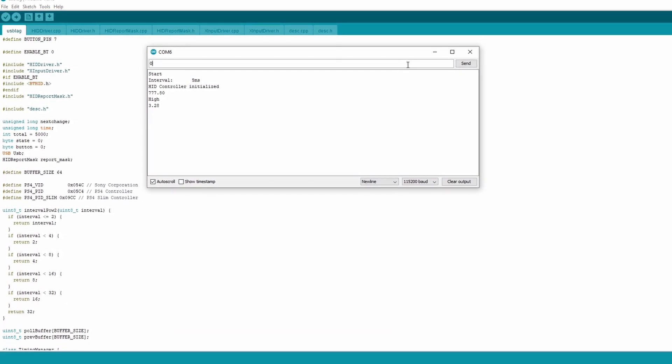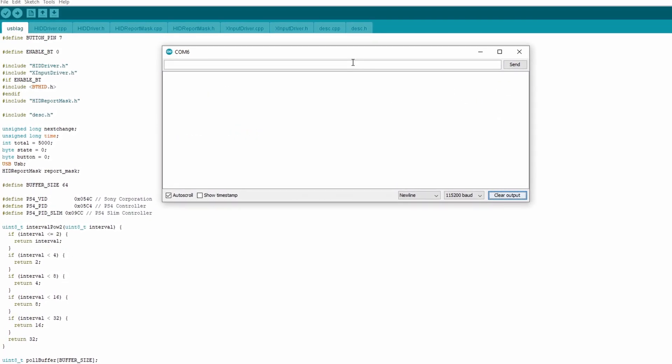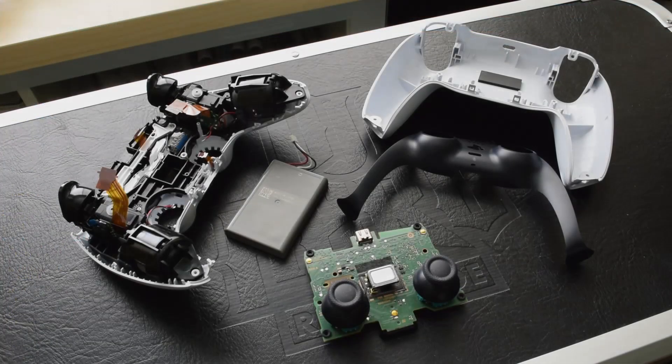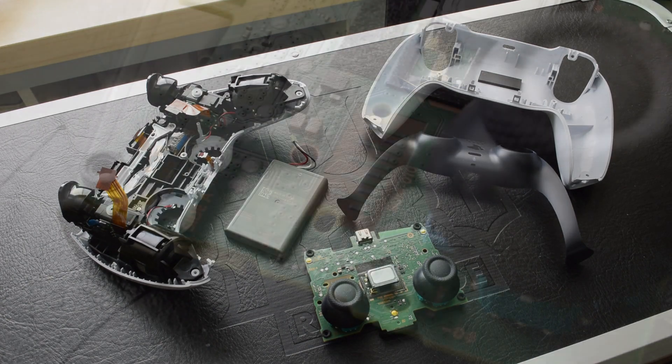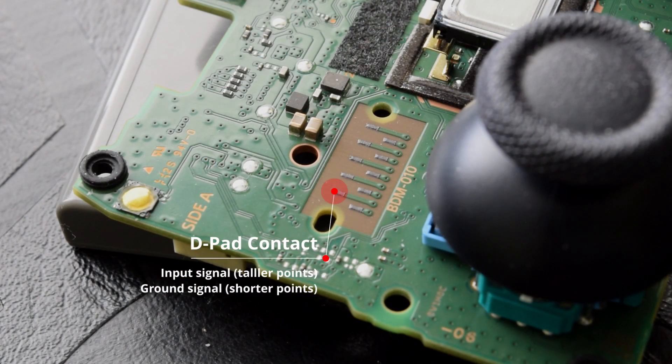I would then connect my device to the host shield. Afterwards, I would use an AWG wire with one exposed end on pin 7 of the host shield and another to the test subject's input. For the DualSense, I would have to open it up to access the main PCB. While I opted for button inputs in my tests, the Arduino wasn't able to identify them at all, so I had to use one of the D-pad inputs found on the front of the PCB to do my testing.